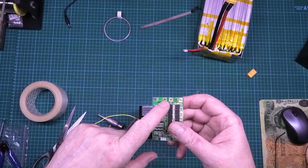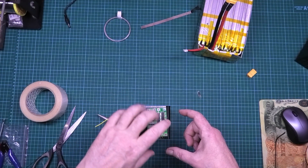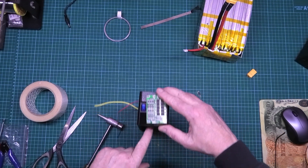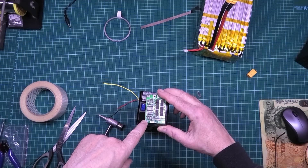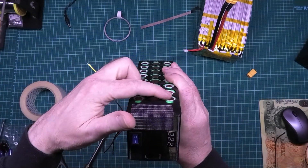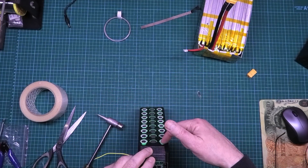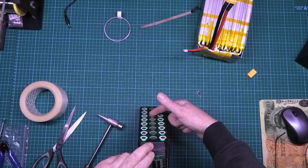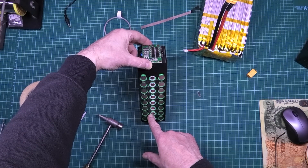I'm wiring as per the BMS. Although the power connector is at the bottom of the BMS, it goes at the top of the pack to give enough room to route the wires down. If the BMS goes there, that's negative, so you have to make sure your negatives are at the bottom. You put a series link across the top, then another series link across the next row. That gives you 8.4V at two cells and 12.6V at the top — a 3S pack.